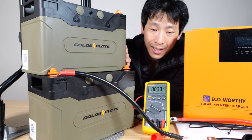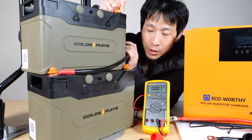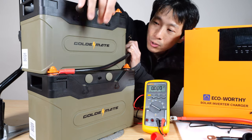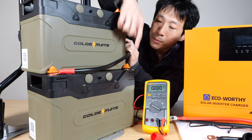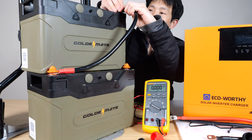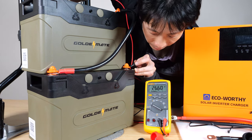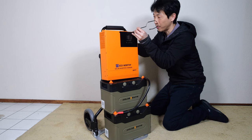Now that we know the voltage is exactly the same, we can connect them in series and stack the voltages on top of each other. The negative to this positive terminal is 12 volts, and you want to stack on top of that — put the negative terminal on top of this positive terminal. From here to here is 24 volts. Bolt it down, put the cap on, and this should read 26.6 volts. I'm securing them with some zip ties on the top for now.